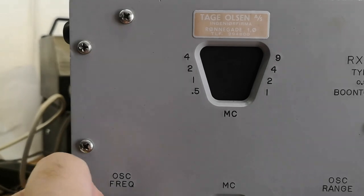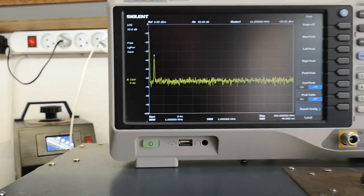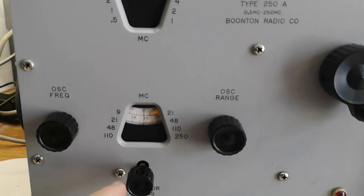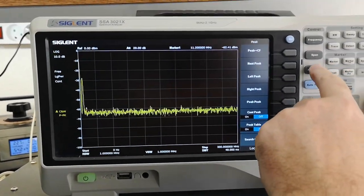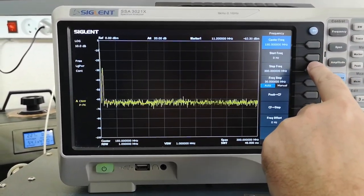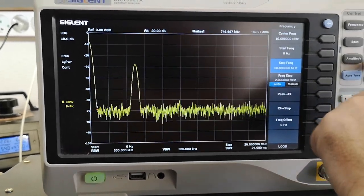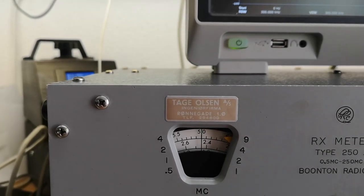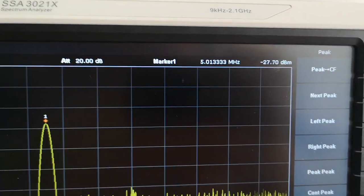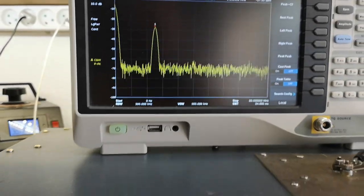In the 9 to 28 MHz range I set it to 11 and get a peak at 11 — so all in all the oscillator is really working. Changing the stop frequency to around 20 MHz shows a nice peak at 4.9. Setting it for five gives a peak right at five. This unit is from 1954 and it's still super accurate — amazing.